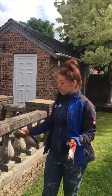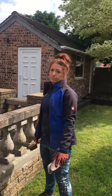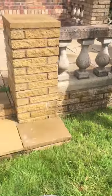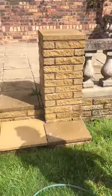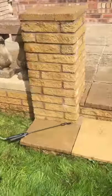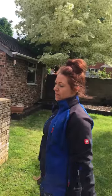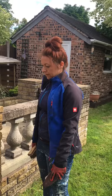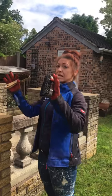But had you never pressure washed it and always just sprayed a chemical on it, you've probably never got the lichen. It's the biofilm — it's simply to protect the stone, like a skin to protect it from erosion. And what precautions do you take to protect the greenery around? I see there's lots of grass and you've bagged the plants up there. The plants have been covered up. But as long as you mix your chemical correctly and you have enough surfactants in it to make sure that it adheres to a vertical application, then it won't run off. You need to make sure it has enough surfactants so that it clings.